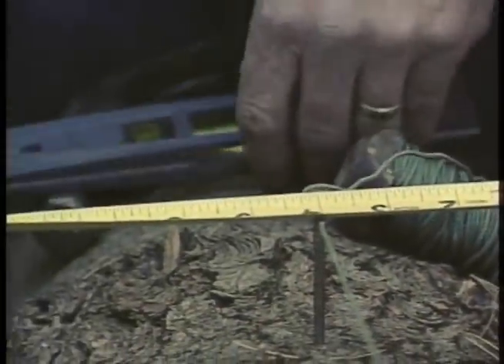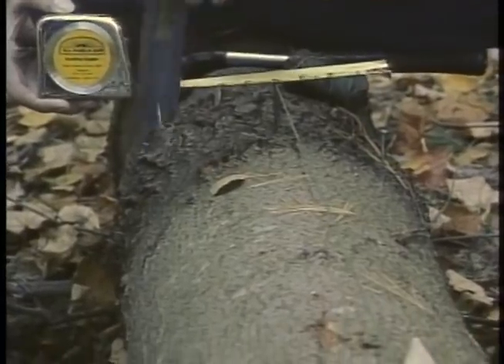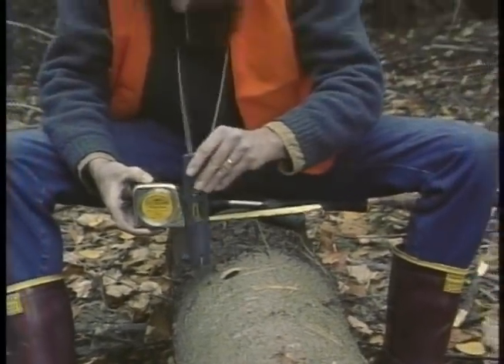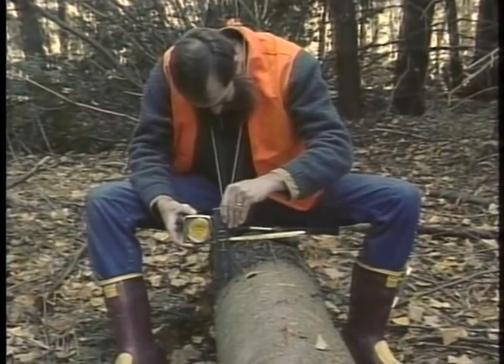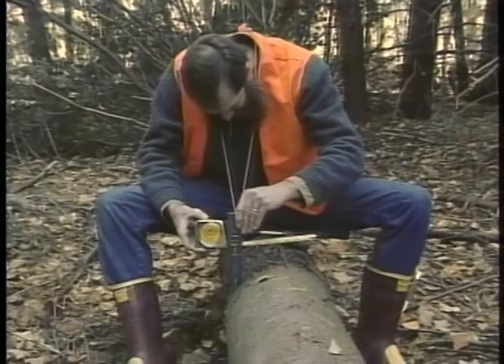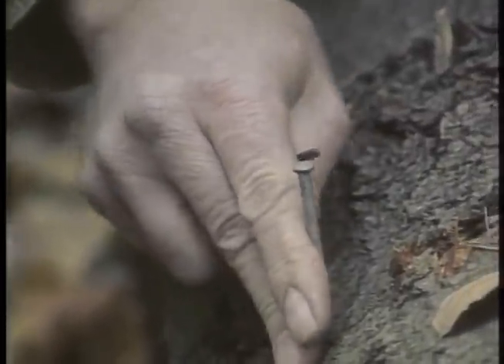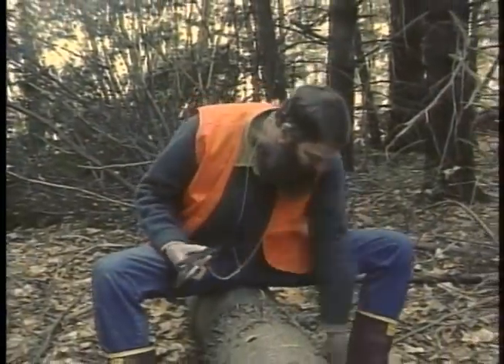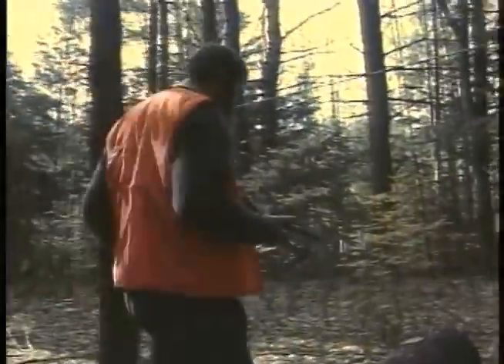If the tree was straight, I would be looking for the center of it. But since the tree is not straight, it has weak places and strong places, which means I'm looking for a kind of compromise. If there's a bad place, I'm going to want to be in the center of that bad place, because then the beam will be stronger. This tree is pretty good. So now we have our sort of center of strength here, and now we have our eight-inch beam set out. Now I'm going to do the same thing here — run this string the same way up the tree, butt to top.